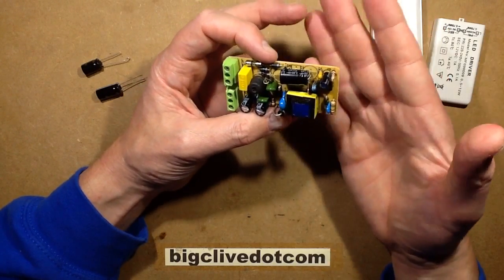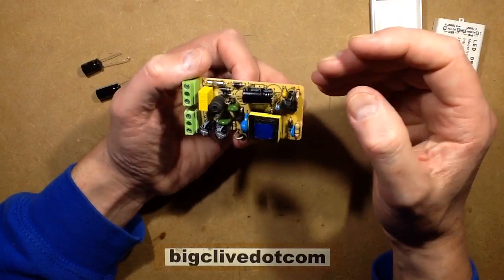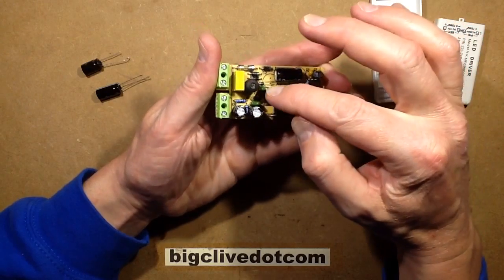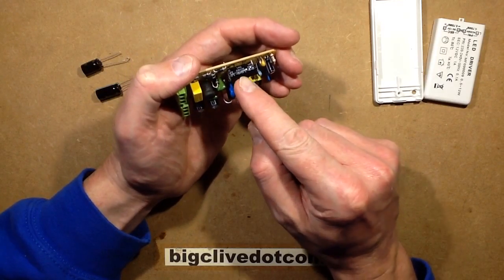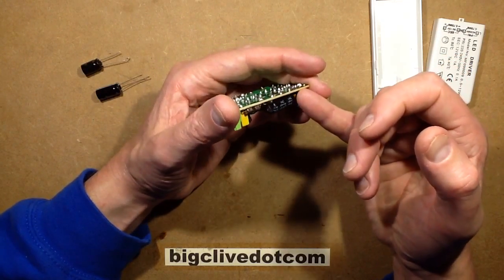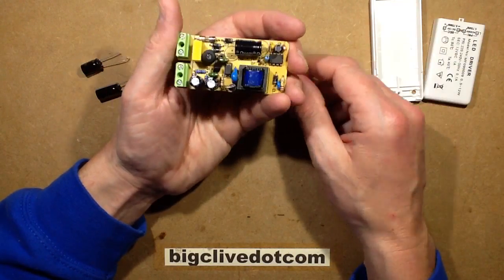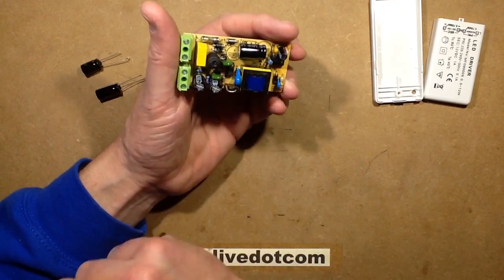So then I thought — next suspicious components. I can check resistors easily and test them in-situ. Next are the capacitors. I desoldered a couple — there's a small ceramic capacitor and a mylar film capacitor. These types tend to be go or no-go, unlike electrolytics which can show the correct value of capacitance but actually have a high internal resistance. The worst thing that can happen with ceramic capacitors is moisture getting into them, but that hadn't happened here. I took those capacitors out, measured them, and they were fine. So I'm thinking it could be the chip that's faulty, though I don't think it's the feedback circuit.